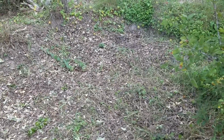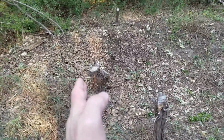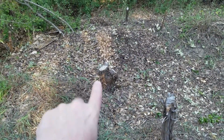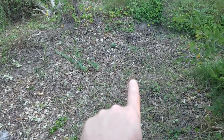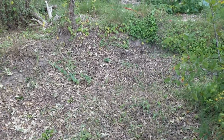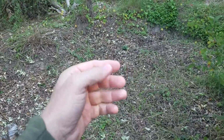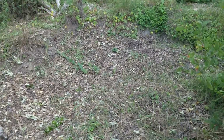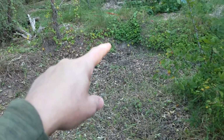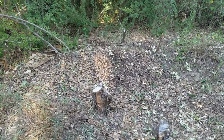When we would have rain, the creek would flow for like 6 months on a normal year. And even if it didn't blow the banks to fill up this spot, which it would occasionally do, just the water flowing across here would seep into this lower spot to the right. And it would create basically a stagnant mosquito pond. So I decided what I would do is knock out the creek bank, let it flow into here, and as it got wet, I would dig out the mud and plop it all along the banks. So if I dug a foot down, then I was able to put about a foot around the banks. It's giving me 2 feet of depth. And that's basically what I did.